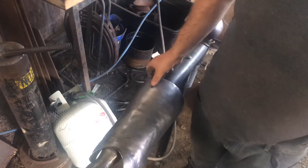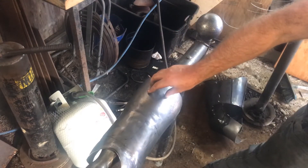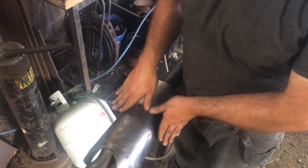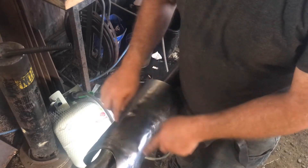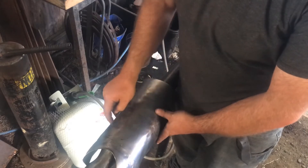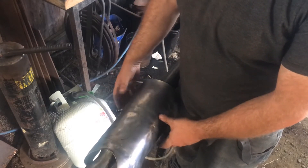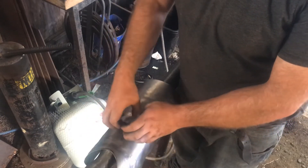What we're going to be doing is shrinking this section here, working from both sides and bringing it into the center. It's also going to make this part stronger — it's going to have more material. We're going to take that material from everywhere and bring it in.